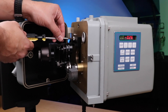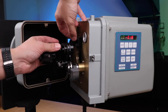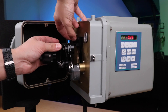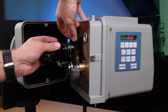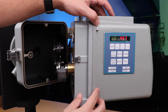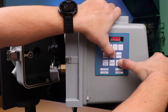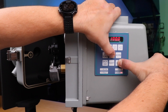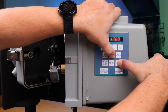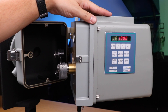Once the normal set is complete and the set light is out, you can now perform the zero set. For this last set, you should remove the cal-fixture. Initiate the zero set by holding set and zero until the set light is continuously illuminated. Once the zero set is complete, the unit requires two calibrations to calculate dirt. This would normally be done with the unit returned to normal, but we are leaving the unit open to show the cal mechanism.